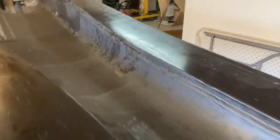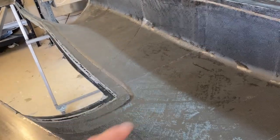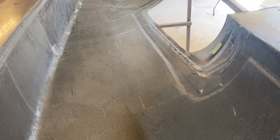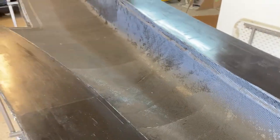It all pulled down really nice and I think it's gonna be super stiff, so very happy with that. Now this left fuselage side is nearly complete. I'm gonna do one more step: put a layer of Kevlar from essentially where the firewall goes all the way back to just behind the cockpit bulkhead. The reason for that is, should I have an unfortunate event and hit the ground harder than I'd like, that Kevlar will help contain the carbon splintering — carbon tends to turn into lots of little sharp knives when it fractures, especially under high energy. It won't add much weight and it'll add a whole bunch of peace of mind. Then we'll do the same to the other side, and the next big step is joining the left and right fuselage halves.